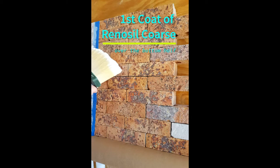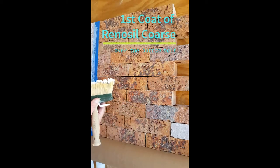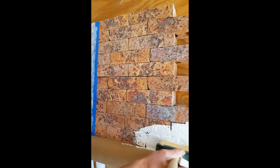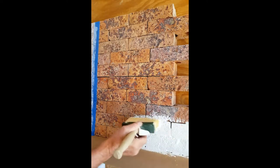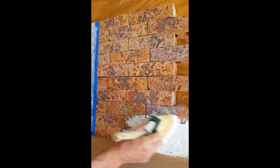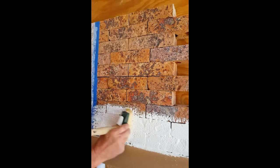See my paintbrush? I've loaded up with some paint. Now we'll make the application. I'll be working from the bottom up. I just work the paint in using circular motion of the brush. I need more material — I'll grab some from the bucket. Kind of stipple it in a little bit as I go along to help fill those pinholes. Paint dries pretty quick, about eight minutes for that first coat. But it has to cure overnight before we brush it again, just as we did with the glaze.